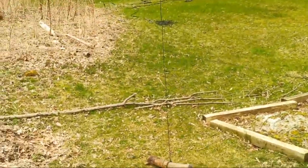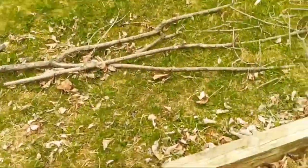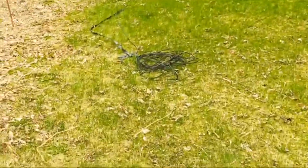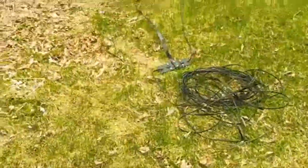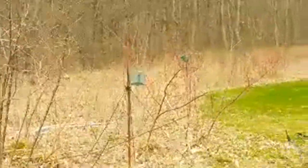We've got some carnage on the property — the freaking wind has torn everything up. There's the coax. Taking the folded counterpoise down — that's on the ground — so I've got to pull that apart, tear it all down, and remove the one-to-one choke here.